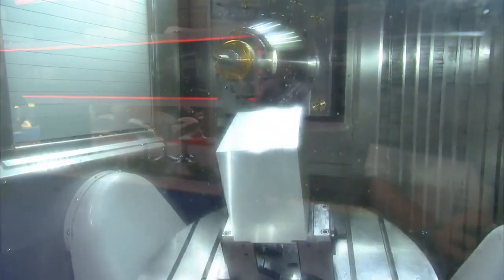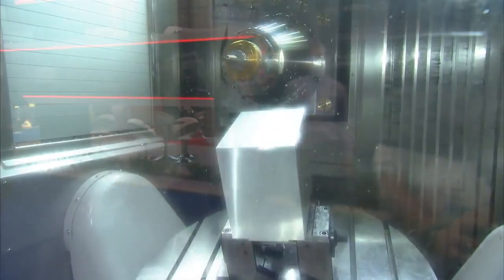You've got a different head on this to what I would normally associate with a 5-axis — that's like a ram. We've got different spindles. So a wide range of applications coming from high speed, 30,000 RPM, HSK 63, up to 1,000 Newton meter with an HSK 100.